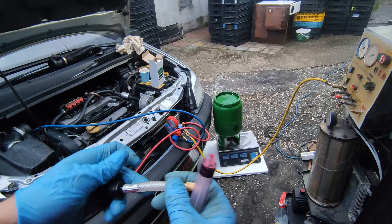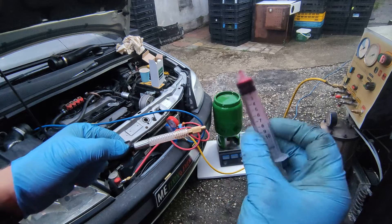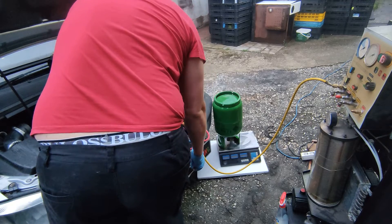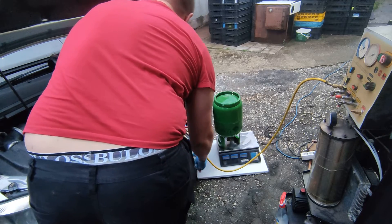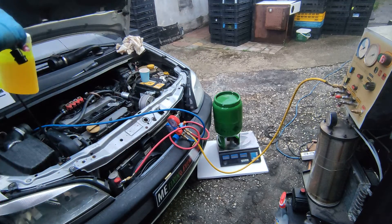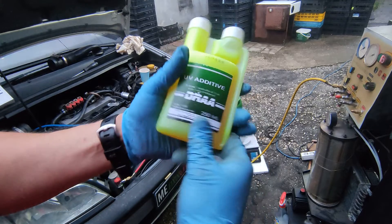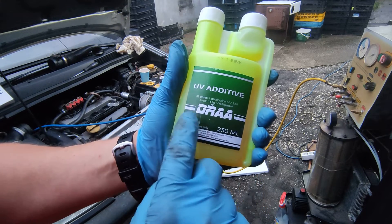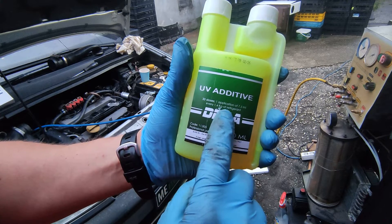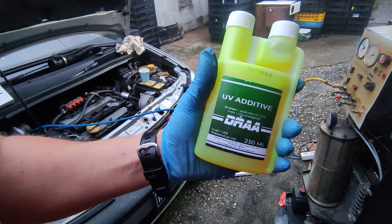It will be a better thumbnail with a syringe. That's a quick connector that goes on the low side and the vacuum pulls this UV dye in. This is the dye I'm going to use — not sponsored, just the cheapest one. It says 250 milliliters and 7.5 milliliters for every 1.4 kilograms of refrigerant. This system is only 700 grams so I'll still use 7.5 milliliters.